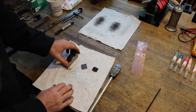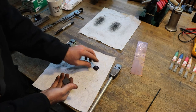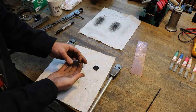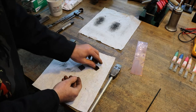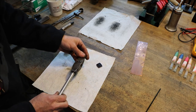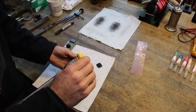So back about 5 or 6 years ago, when I originally got into hand scraping, I needed some carbide blanks to turn into scraper blades. I bought a random pack of large carbide inserts, just regular insert tooling, nothing special, because I wanted to turn it into scraper blades. I ended up making a holder for these inserts, and I used them. They worked just fine.